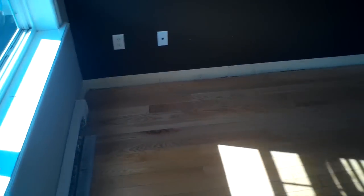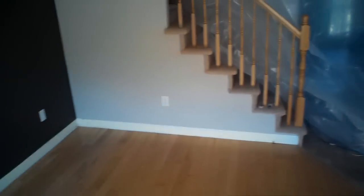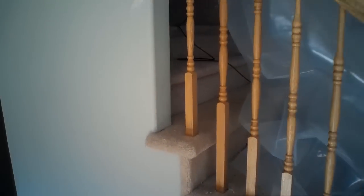There's the hardwood down there, also looking fresh. Quarantining off the living room space because we're going to be sanding all this hardwood down - it's going to make a lot of mess - and then we're going to stain it so it all looks the same. Right now you can tell what the newer stuff is and the older stuff. Then we can put the baseboard back on and the living room will be done. Pretty productive day and the carpet's all done too.